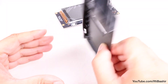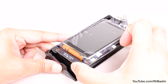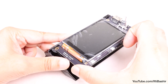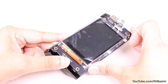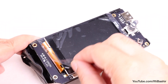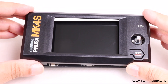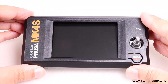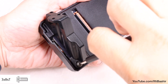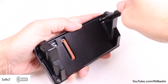With that in place, back to the LCD board and the rear cover. Holding from the edges, slide the display board into the notches in the top of the rear cover, and seat the board down into place in this orientation, so the control knob is on the right side, before removing the plastic protective film and lowering the top cover down into place. Flip the assembly over and secure from the rear using three 3x8 screws — one in the left bottom and two on the right side.